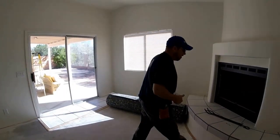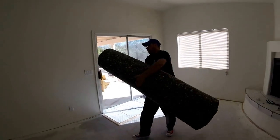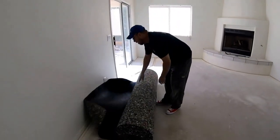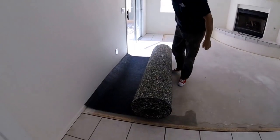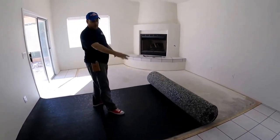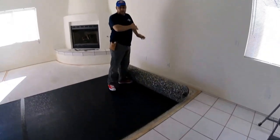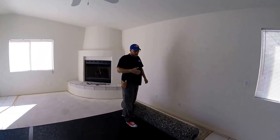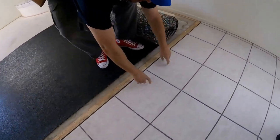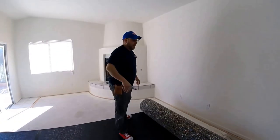Now that we've figured out which way to run it, I'm going to get myself just a couple inches up the wall right there. I definitely want to start up here along the long flat wall. You always want to start on the longest straight wall to run your pad. You don't want to start on the side that has doorways, because you'd have to pull the pad up enough to reach the tack strip in the doorway, which causes you to trim all the rest of the wall off.